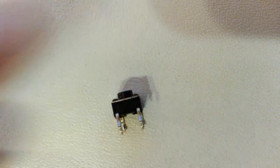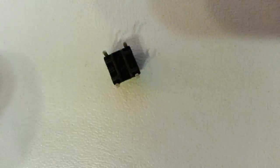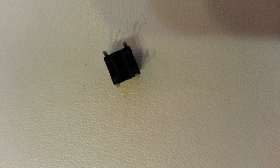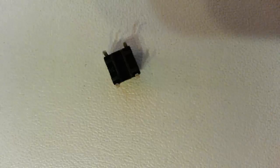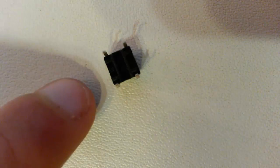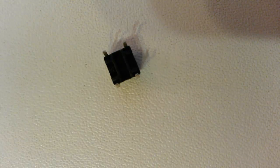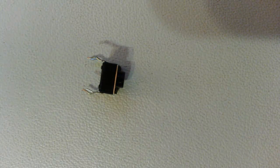Most tactile buttons have four metal leads. Just like switches, buttons can have multiple leads. In this case, two of the leads are one switch — they're disconnected, you press the button and they get connected. And the other two leads do the same thing, just separately. So you can hook up two separate things to this button. There are many different types just like switches, but you can look those up online — they're not hard to understand at all.